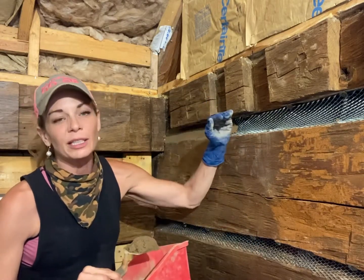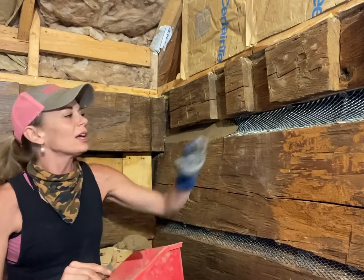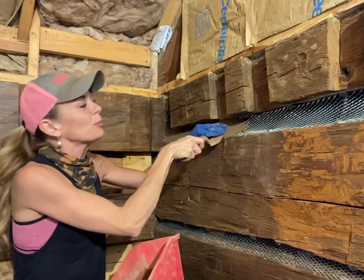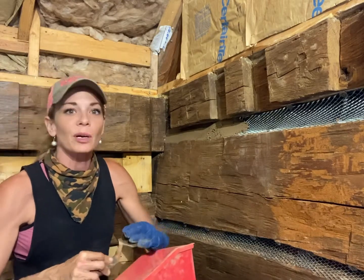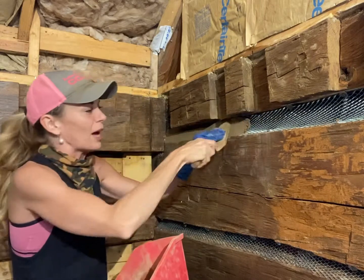You want to sit your chinking back on the top, maybe 1/4 to 1/2 inch for a drip edge, and then come out flush on the bottom. And the reason for that, it's more important on the exterior than the interior. That's where the rain falls and the water runs. So you want the water to run properly. Of course, you want that to match inside and out.